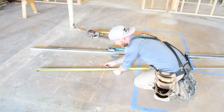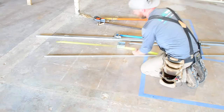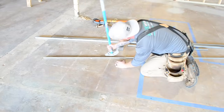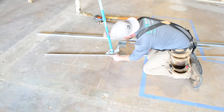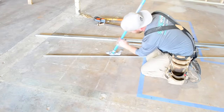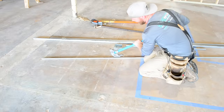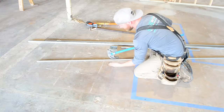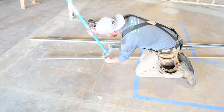That's 1, 2, 3, 4, 5. Now this is the mark we're bending with. So if you can think about this for a little bit, once we put this arrow on that front mark, when it bends back, the end of that pipe is going to line up perfectly with this mark. So that's how you would get your 36 inches. So let me get this on the arrow.